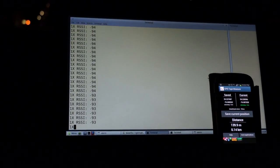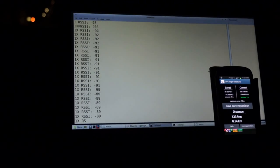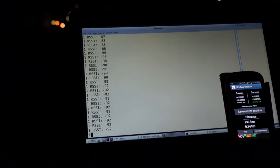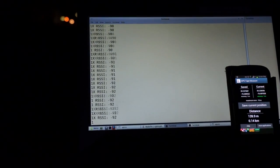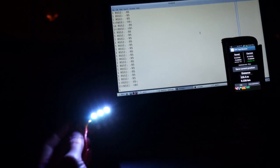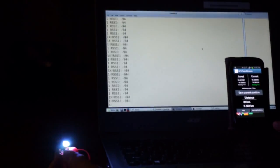We're only at 139 meters and we're already getting some drops here and there — actually, a lot of drops. I guess it's orientation dependent. Everything is wrong, so. I don't think this is going to go nearly as well as the other ones did. Like my Wi-Fi cup video — if this thing goes out of range, the lights get dimmer. So already you can see whenever it's not getting those packets back, this thing starts to fade out. It's been spending a lot of time off, not very much time on. So at 226 meters, really not all that many packets are getting through. It's not very good here, but it's kind of getting through. If all you needed to do was get a current or temperature reading or something, you could probably do it from here, even with this awful design. And we're at 303 meters.